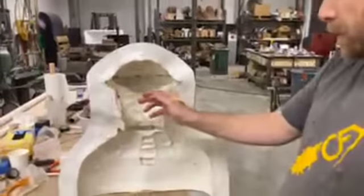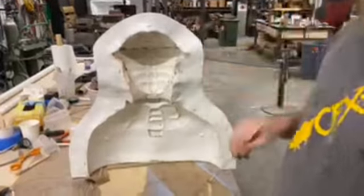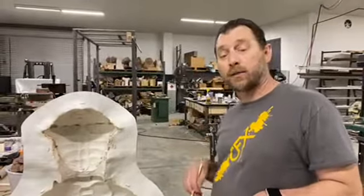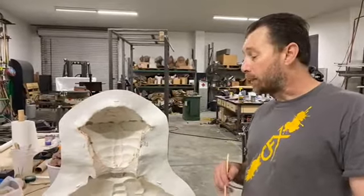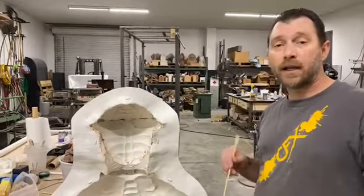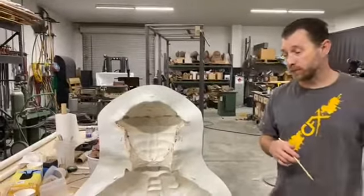But I got some clay built up down in here. There's some cleanup to do up in there. I'll nylon brush it with some solvent, and we'll clean the rest of that out of there. We'll get it as clean as possible. Then it goes in for hardware, so it'll get screw taps all over the place. The core will be reinserted into it, and it'll get poured with some silicone.